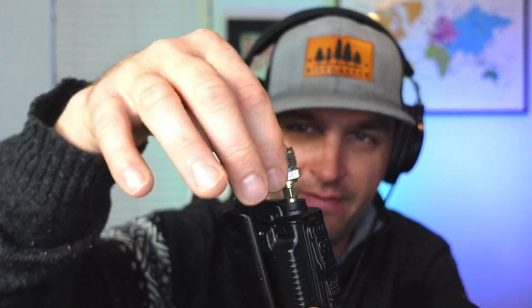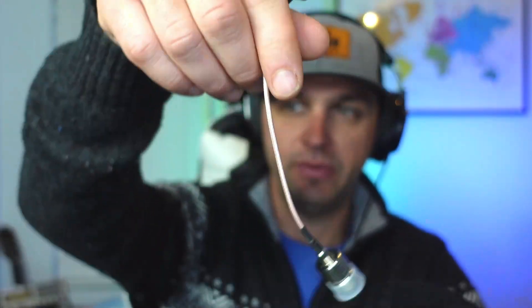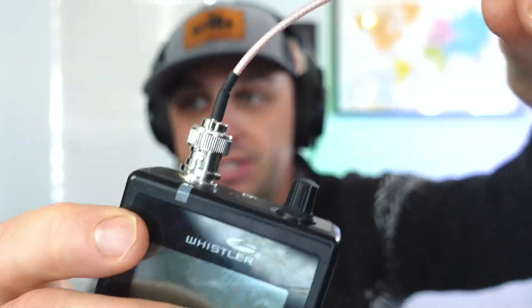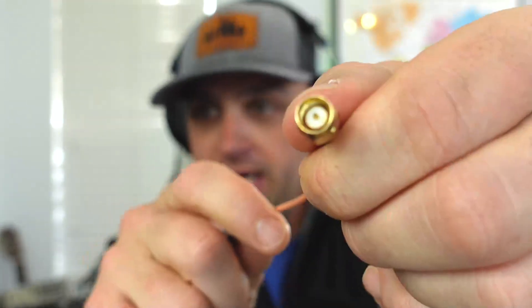Even with this setup, you're going to have a lot of weight and pressure on the base of the radio connector. To alleviate that, you could use a PL-259 to SMA male cable instead — I'll link one below. Also, that connector I showed you just now was actually a BNC connector, which is another connector type. You'll typically find BNC female connectors on PL-259 adapters — female because there's a hole inside. You can go BNC male — it has a little plug in the middle — and screw it into your scanner, then go out to your antenna. The cable I meant to show was an SO-239 to SMA male cable.